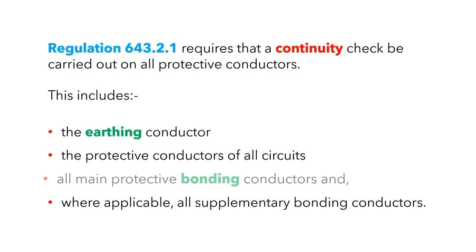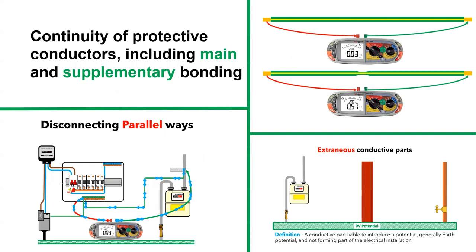Just bear in mind that if you cannot see the earthing conductor throughout its length, then you will need to prove continuity, which I will talk you through in my next video where we discuss how to test the bonding conductors using test method 2 and what potential faults you might come across when fault finding — how to identify them and how to rectify them.